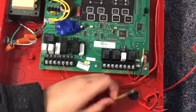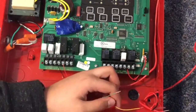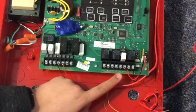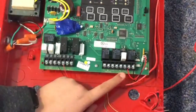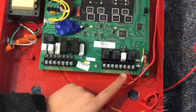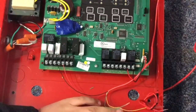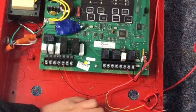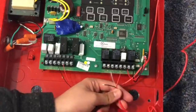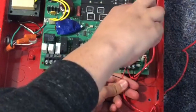Now is the part where you need to be careful, because you can damage your amplifier. But it's very simple if you get it right. This is a dry contact relay — we have a normally open, normally closed, and common. C or COM is common, NC is normally closed, and NO is normally open. We're going to take our input from the amplifier and put it into the common terminal, which is the C.